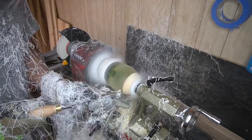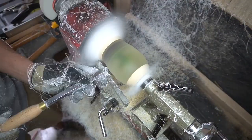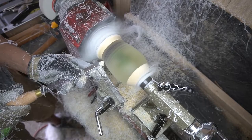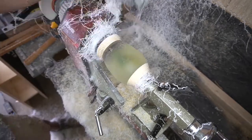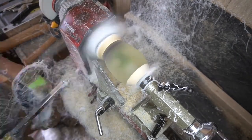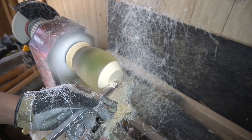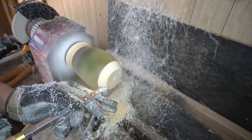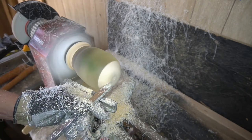You can see we're getting some good shavings off — a lot of shavings there toward the headstock — and just getting that good shape in. So far, no chipping, and I couldn't be happier with it. Here at the base I had a little bit of problem with some chipping, which was kind of aggravating. Once I got it pretty much to the shape that I wanted, I was like, let's not get greedy. I could have taken off way more material, but for my first dip and first casting with a minifig, I just wanted to get a project under my belt. Here I'm taking my square carbide tool and cleaning up the tailstock end, just getting that nice oval type shape.